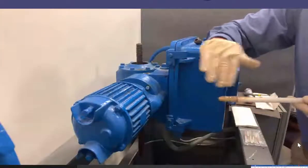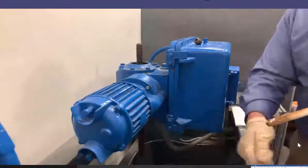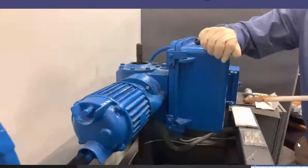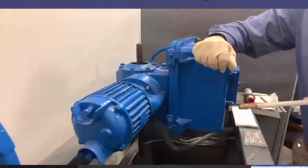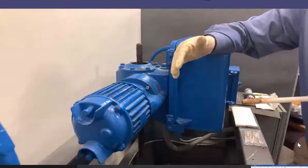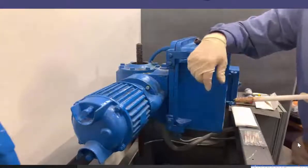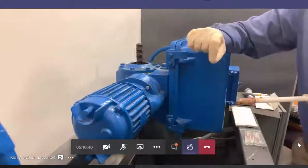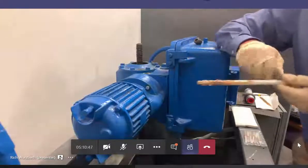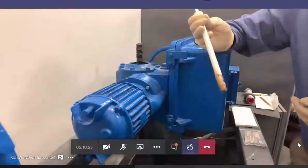Assessment can be as simple as looking at what's inside the clear body of the sampler. In the field, you can extrude it onto a white piece of paper and look for discoloration, particulate, or darkening relative to the new grease type. Or you can send it to a laboratory for advanced analysis including wear particle analysis and grease condition assessment. Some things we heard about today — grease condition, life extension — we can assess in later stages by looking at how much wear is present and how severe it is. I'll open it up now to any questions about the stem key or the gearbox sampling devices.